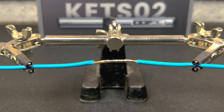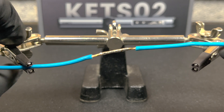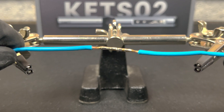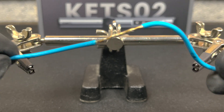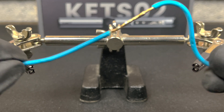We're going to let it cool down first and then take a closer look. Looks pretty good. The soldering iron had no problem heating it up all the way, so the solder really got in between the copper strands creating a strong connection. Feels really solid.